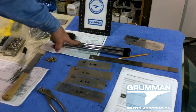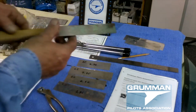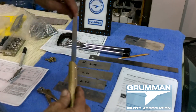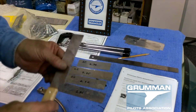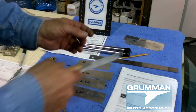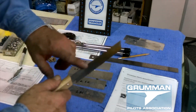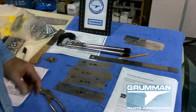You also have a rivet squeezer. The most important thing you can do is get a hacksaw blade or go to Harbor Freight and get an eight-inch Japanese flush cut saw — it's a very thin 1/32-inch blade that cuts when you pull. It comes in very handy. A couple of tricks: as you're cutting the fiberglass, after you get a couple of inches in, the fiberglass wants to close in together. Take a piece of 1/32-inch stock or something a little bit bigger and put it in the cut — that way it won't bind the saw as you're cutting down.